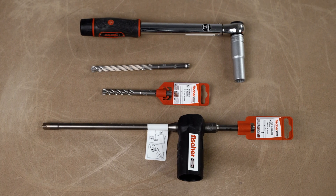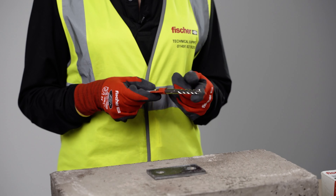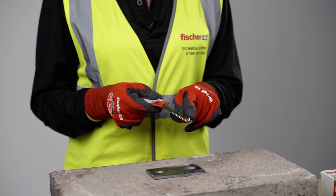Quick summary: make sure you use the correct anchor as specified. Have correct tools and all installation accessories as listed on the packaging. Use a quality PGM drill bit and make sure it's not worn — check the wear marks. Drill to the correct diameter and correct depth. If fixing horizontally, clean the hole to remove any debris, or use Fischer hollow drill bits. When fixing vertically, hole cleaning can be omitted; however, if drilling downwards, increase the hole depth by 3x the screw diameter.